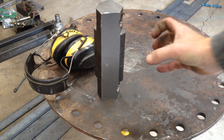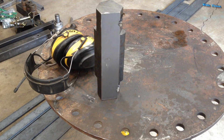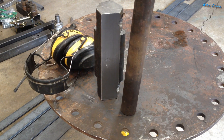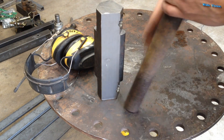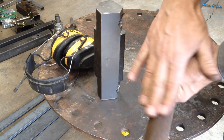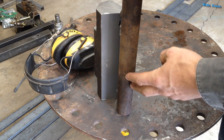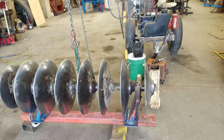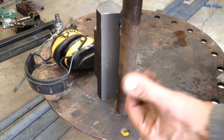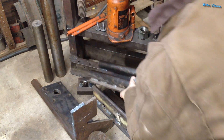The other part of the die — the side that will bolt to the two-way cylinder on the press — I'm going to use a rod shaft to push the metal so it comes down and bends it. I'll go around this nice edge here. The reason I'm using this shaft is it's off an old disc plow, and it's pretty hard stuff, so it can really handle the abuse. It's actually what I used on my bottle jack press to build the bottom die, and it holds up really well.